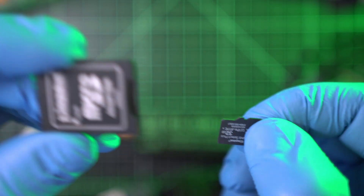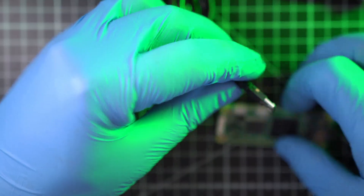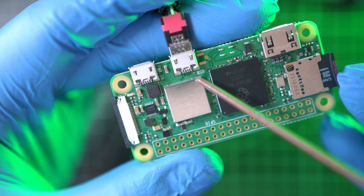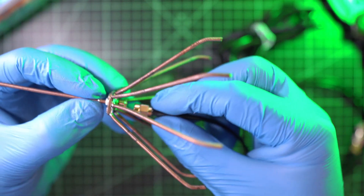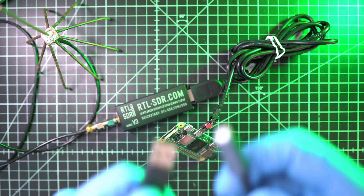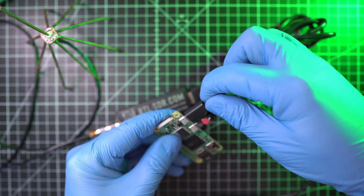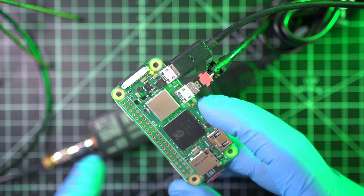Now insert the SD card into the Raspberry Pi. I'll connect the RTL-SDR with the Raspberry Pi using my cable — on the Pi Zero 2W the second USB port is for data and the first is for power, all labeled next to the ports. Next I'll connect my DIY 1090 MHz antenna using an RF cable with SMA connectors. Last is power via a classic USB to micro USB cable — your grandma should still have one of those.